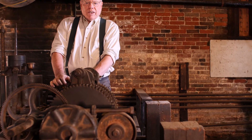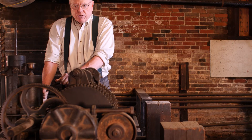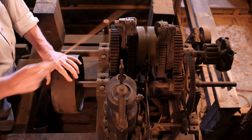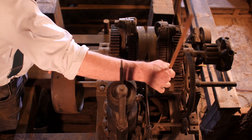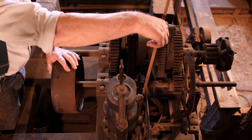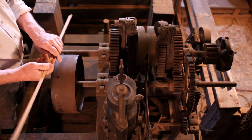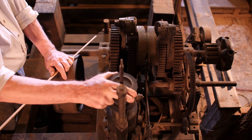The way it works is that this wheel is rotated by the main shaft, which rotates a series of components that drive an oil pump inside down here. This is the oil reservoir. There's a piston in here. The faster this goes, the more pressure there is on the piston. The piston moves up if there's enough pressure to overcome these two adjustable weights and this spring.